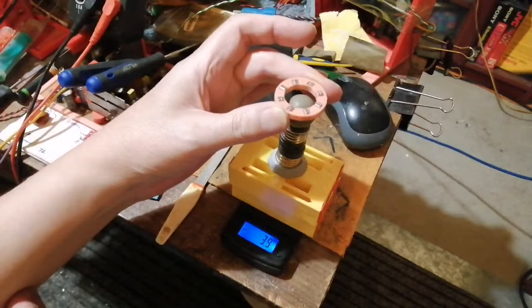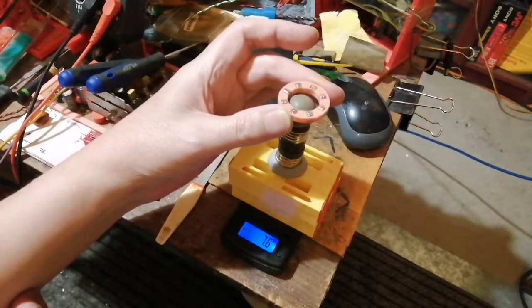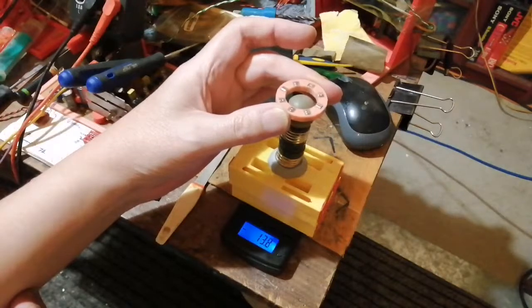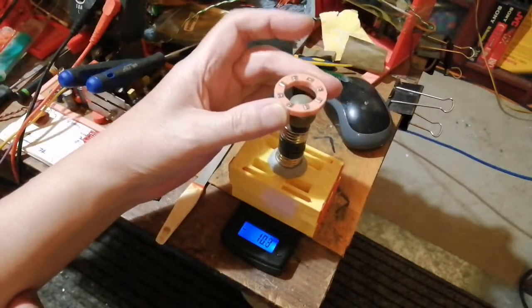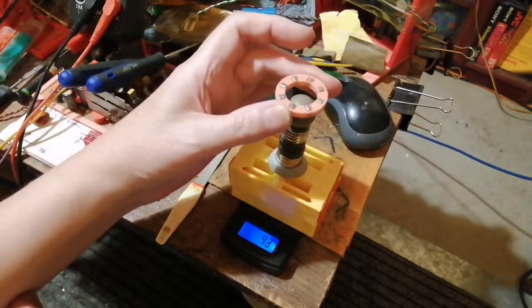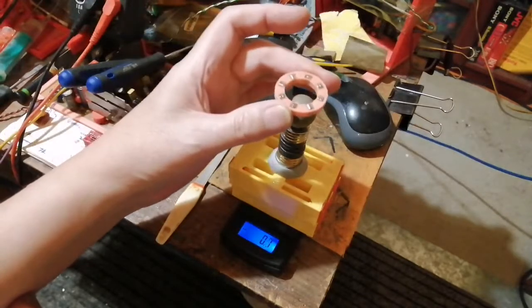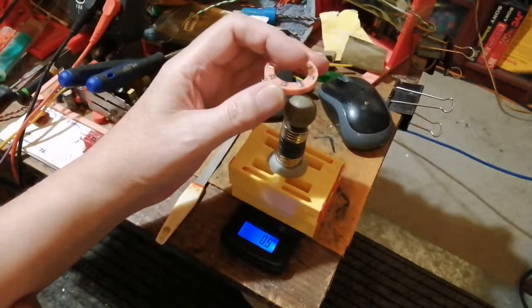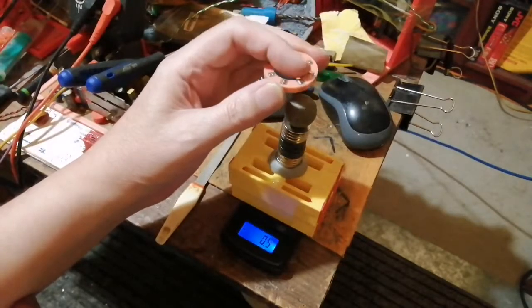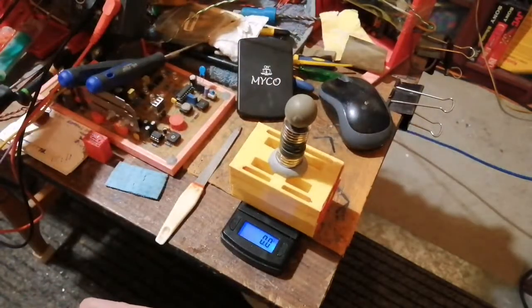It's showing a minus reading of 13 grams, which is virtually nothing, right? But there's a strong field coming up. Obviously the ball's magnetized anyway, so it's not going to be valid for me to stick my gauge on there, because there's no core material and we won't get a true reading. The core material's got to be in there. I don't know if I've got a ferrite core material I can stick in there.